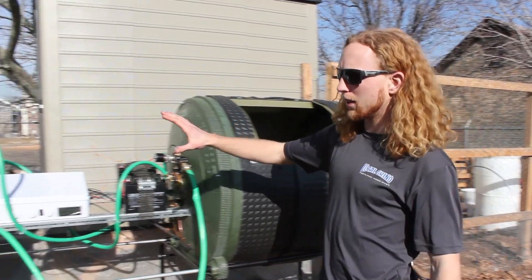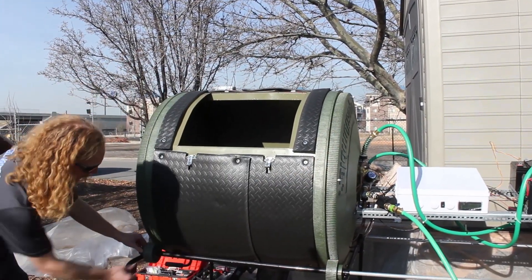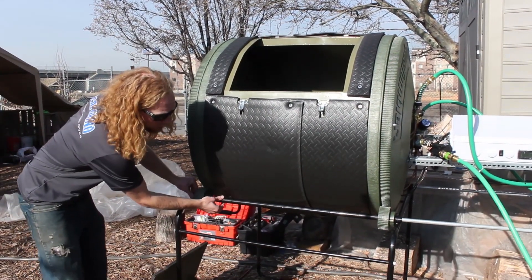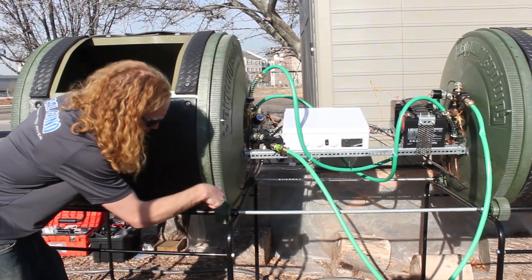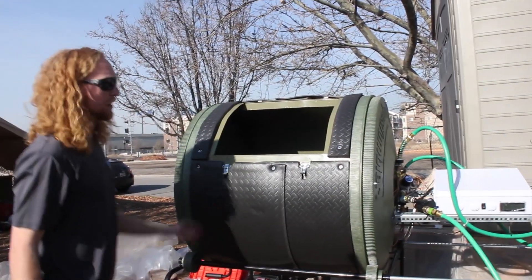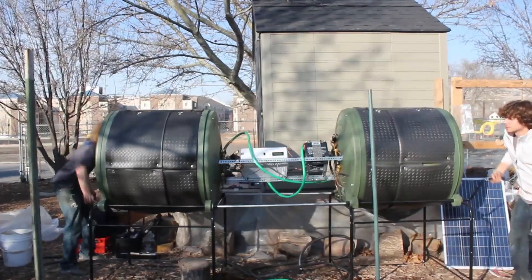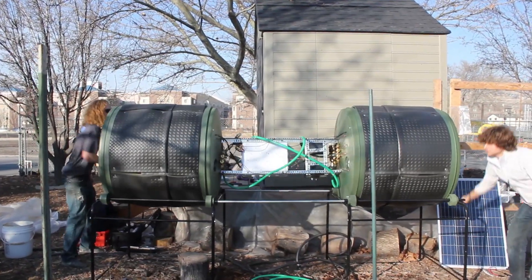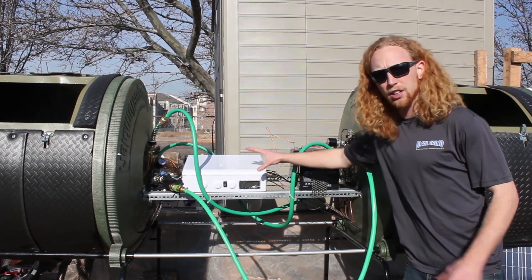There are two individual tumblers which both rotate on gear mechanisms. The axles of each of the tumblers are connected with this through rod right here, and there are pins that hold the axles together. That's useful because you can rotate the entire system together, which means that your wires for your electronics and your battery aren't going to get twisted.